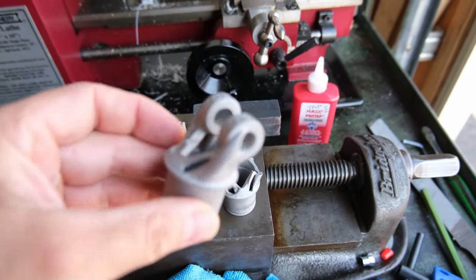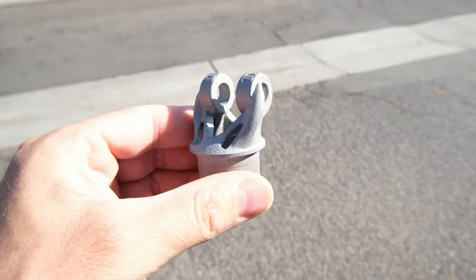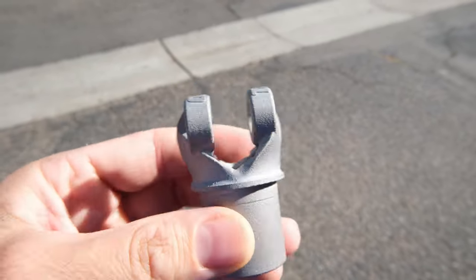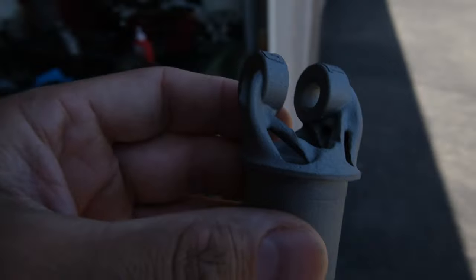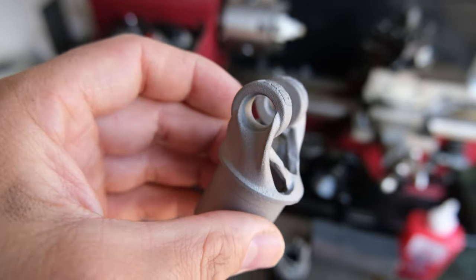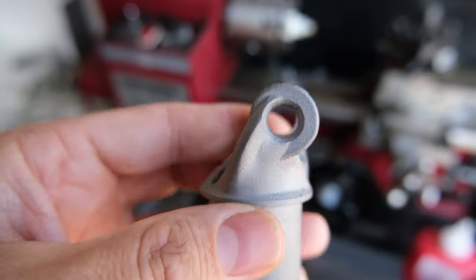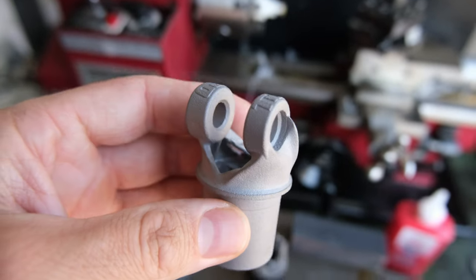Now I'm on the last resort I can afford — a tool steel 3D printed part. It's a very strong alloy: maraging steel. In billet form it has an ultimate tensile strength of around 300 KSI, which is insane. I'm going to attempt tapping this hole — I tapered it a little bit to help ease in the tap and reduce the torque needed to get started.